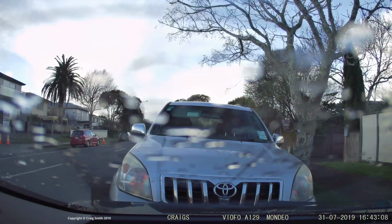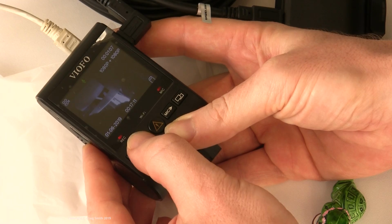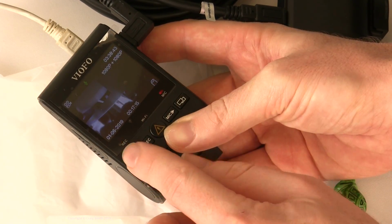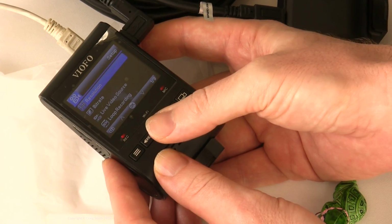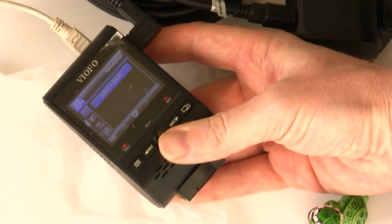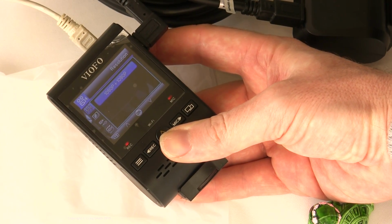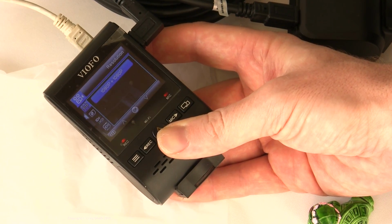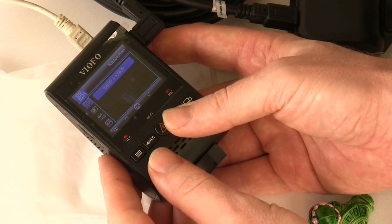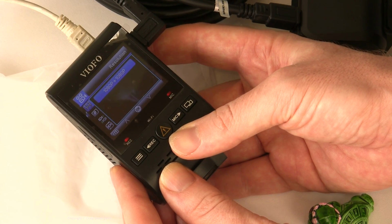One major point that it's necessary to make is, as you can see on the screen, when the rear camera is plugged in, the video mode freezes at this 1080 plus 1080 setting, and in the menu there is no other option. And without the second camera, you get 1080p at 60 frames per second, and you can also dial the quality down if you wanted. But when you're recording with the dual setup, you only get each video stream at 1080p 30 frames per second.